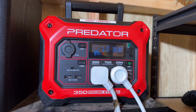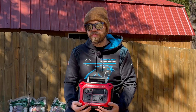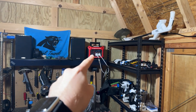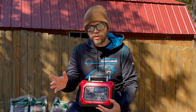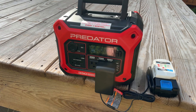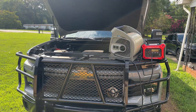The number of watts is the amount of power that you can put out at any given time, and for my particular use case in my tool shed, 350 watts has been pretty good. It allows me to run batteries, a fan, a light — all at the same time. The other number you're going to need to know about power stations is the battery capacity. This one is 294 watt hours. The larger that number is, the higher your battery capacity and the longer you're going to be able to power things before you run out of juice.